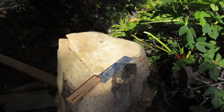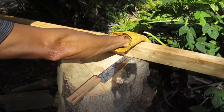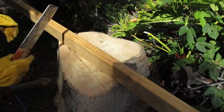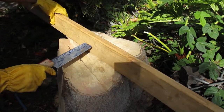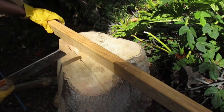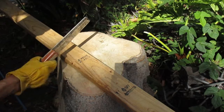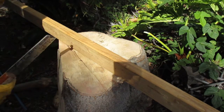I think it looks fine. I've got a two-by-four here — kind of long. So I'm going to cut it into two pieces. I'm selecting — there is a knot right here. This pin knot actually affects the blade: on the regular wood it's softer, so they enter and go in one direction. But when you hit the pin knot, the knot steers the edge to another direction, so you could end up with damage.